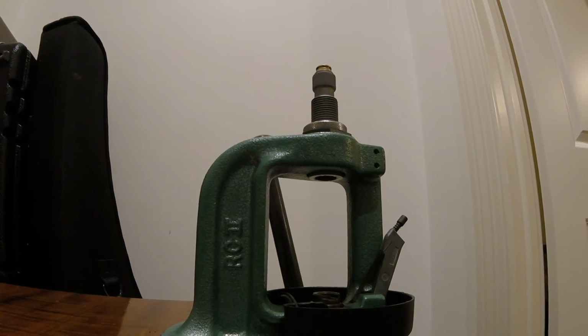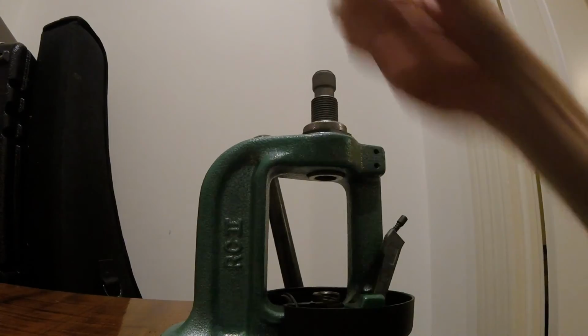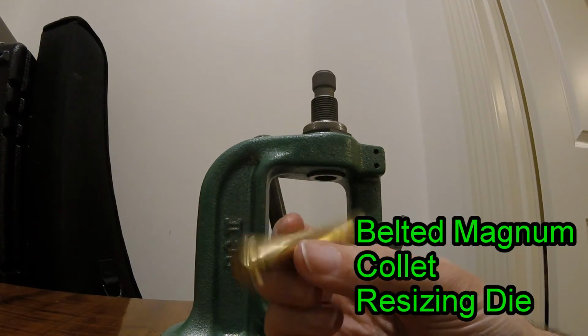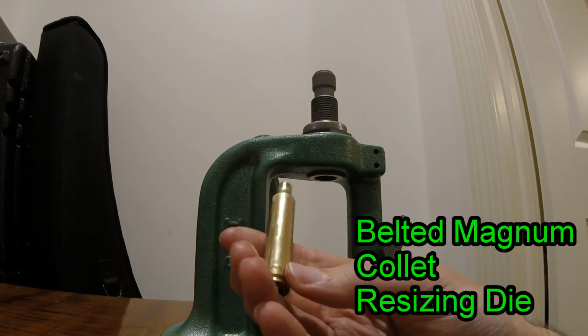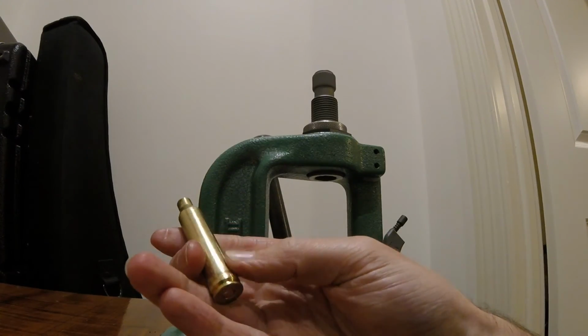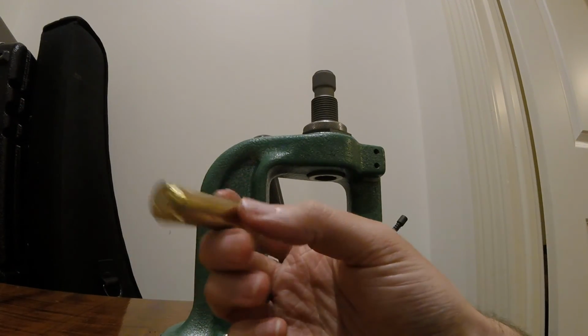And as I said before, this is the first time I've ever come across this issue, and doing quite a bit of research on the internet, couldn't find any videos on YouTube at all about this, which I'm quite surprised with the amount of reloaders that are out there. So I thought that I would just do a quick video on this, and hopefully if anyone else has had the same sort of issues, I recommend that you get onto the internet and look up Innovative Technologies, and look at buying the Magnum collet resizing die. It's a great little invention, and it's obviously saved these cases from going in the bin.